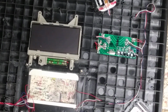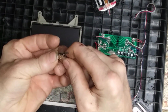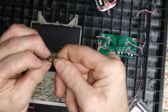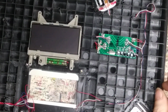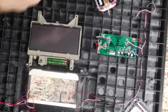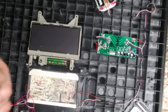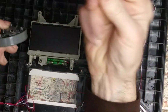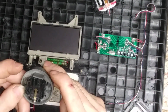So anyways, yeah, that's it. Save the little switch here. That's going to be a single pole double throw switch. It's got 3 attachments on the back, and I'm going to save the load cells and the mounts, and also the contacts here. Where did I put it? Right here. This contact. Because again, you still got the 2 reeds, and once they contact each other, they can send a signal. So that's actually kind of nice to have.